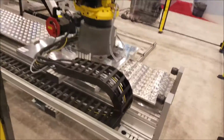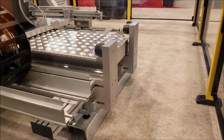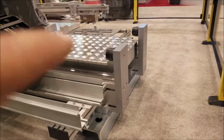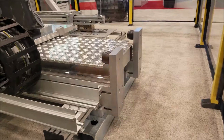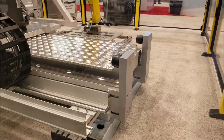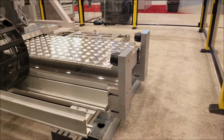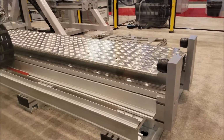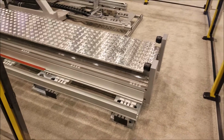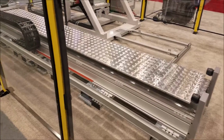The extrusions, you can see that's probably about 170 millimeters by maybe 100. And then the rail there is a size 25, a 25 millimeter rail, and it's machined into that piece while the whole assembly is already assembled. So it's machined as one piece. And this rail is not the ball bearing type rail. This is actually rollers, so we have more rigidity. Oh, really? How about that?